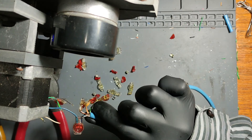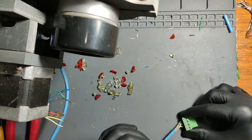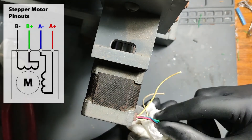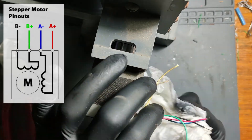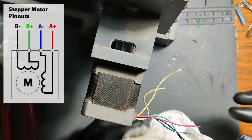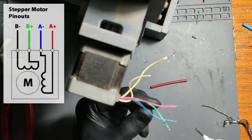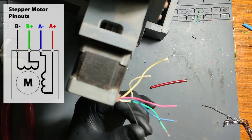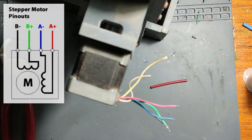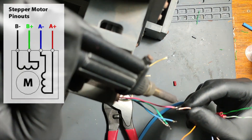If I ran it with those old wires, the output of the stepper driver could short out and damage the driver. So I replaced the old cat 5 wires with new cat 5 wire — or at least wire that was not exposed to the weather. Previously, weatherproof telecom connectors were used to join the stepper motor wires. However now we will solder the wires and use heat shrink tubing. You need to be very careful when connecting motors to the TB6560 controller — they are notorious for blowing up, so exercise caution when powering them. The A and B coils of the motor for the respective axes were connected to the driver with the color code shown. Once connected, the cables were fastened to the motors and frame using heavy duty tie straps.